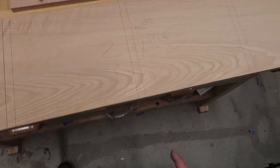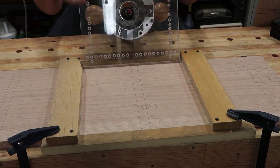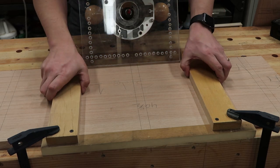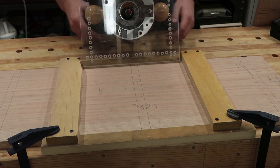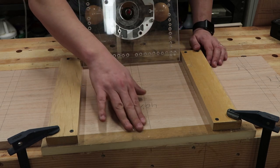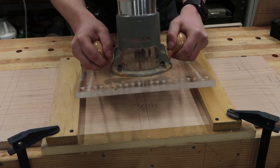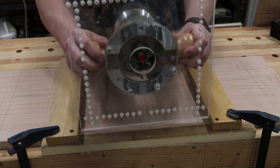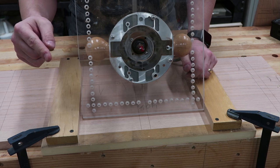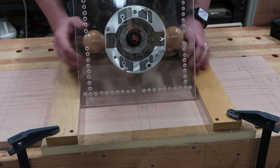Here's how I'm doing the dados. I've got the Samurai Carpenter router jig that I built when I first joined the Samurai school, with a little guide to run it along the edges. I had the depth set at a quarter inch — that's what my math said. There's a split in the wood right here so I have to be careful it doesn't twist on me. I've got a half-inch wide router bit and the boards are three-quarter inch, so I have to make one pass and then move over to the other side.